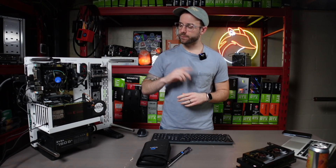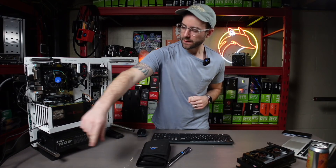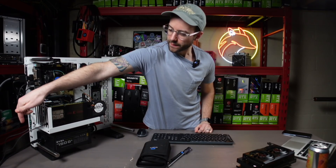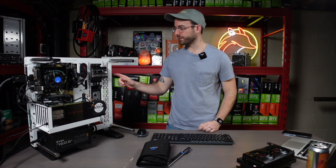I've got the C1100 up on the test bench. Just like a GPU it's on a riser with an 8-pin power connected, and you saw me install the fan already. The other slightly different thing with this FPGA is that it communicates with the miner over USB, which comes out of the front of the FPGA and connects to the motherboard. Other than that, I'm ready to power this thing on — let's see what happens.